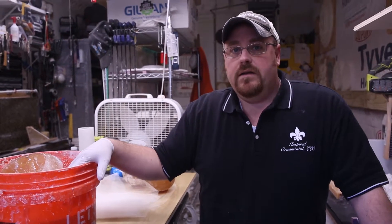We're about ready to mix up some plaster to make a shell on this medallion mold. We've mixed up plaster to create the shell for the brush-on rubber mold we created — that'll serve as the backbone for the mold itself. We're going to pour the plaster on top of the mold and add some reinforcement, and that will be the shell for the ceiling medallion.